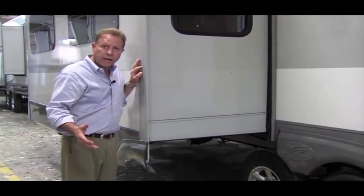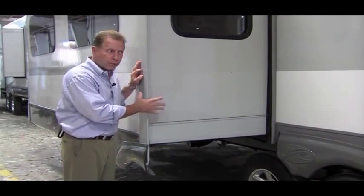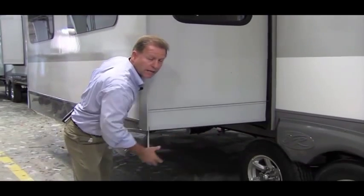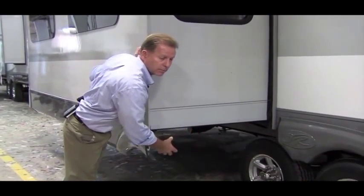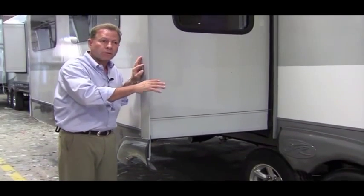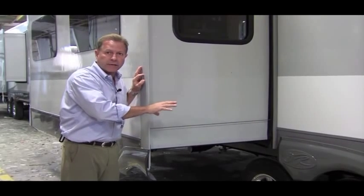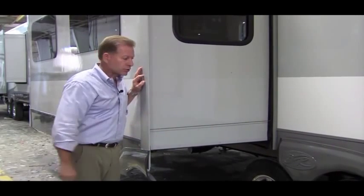The other thing is we're taking weight out. Again, with this system, we're taking 200-300 pounds of weight out per slide out because we don't have the heavy rack and pinion tubes underneath slide boxes going through a big, heavy frame where they have to cut a hole through in the main frame. We can keep our frame weights lighter because we're not boring big holes in our frame.